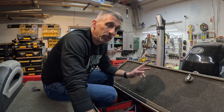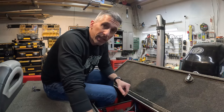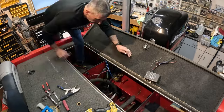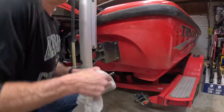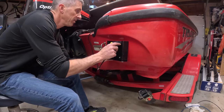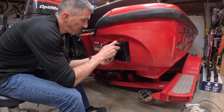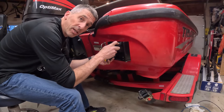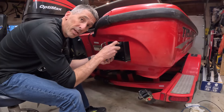We're going to simplify this quite a bit. The longest part will be taking the old Power Pole off versus installing the new ones, so I'm going to time-lapse that. We'll take out the hydraulic pump first, disconnect all the wiring, and then get the Power Pole off the back of the boat. These quick disconnect brackets actually have the same hole pattern as the Power Pole, so I can reuse the mounting template and then mirror it on the other side. I just need to pass the bolts through, get them in, and tighten it down.